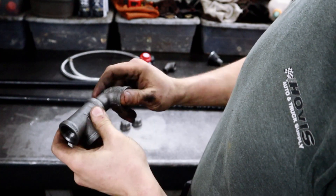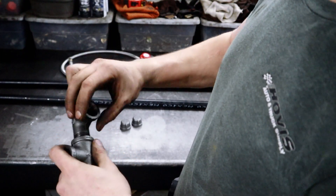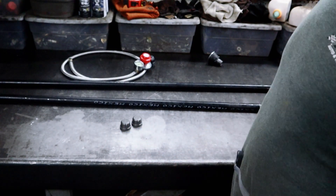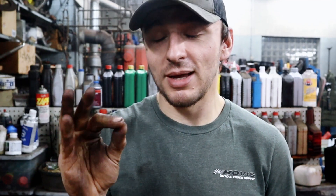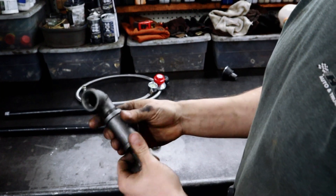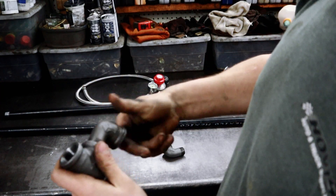So two street 90s like this, right, with two black iron pipes threaded onto the end of that — but that will not fit inside of the bluing tank. I'm not a plumber, but I'm under the impression that as long as the air and fuel is mixed, I don't have to have exactly the same lengths of pipe for it to run properly. I might be wrong — this is all just a big test. After trying it with the tank, I think I'm going to use the tee but only one street 90, and it still gives me the same length, which is ideal.